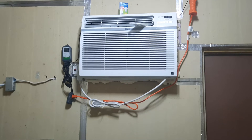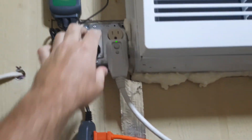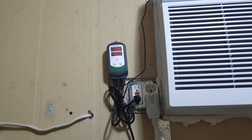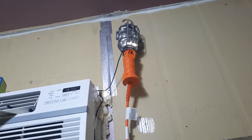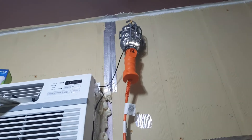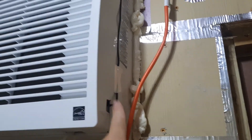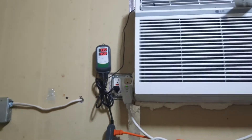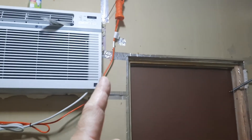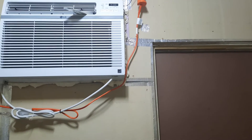I didn't do a CoolBot — I did this thing called an Inkbird. It works very similar to a CoolBot but it costs $35 versus $350. You set your temperature — right now it's set for 45 degrees. Until it gets to 45 degrees that light up there will kick on; when it drops below 45 that light will shut off. This is my thermometer sensor for the air conditioning unit, and this is the sensing line off the Inkbird that comes in right here. Basically it senses the actual temperature and tricks the window unit to heat up that sensor and keep it above the 60 degrees or whatever the air conditioner is set at.